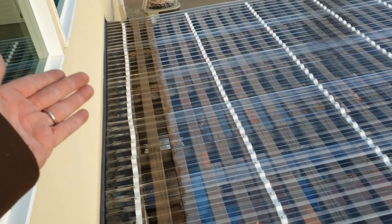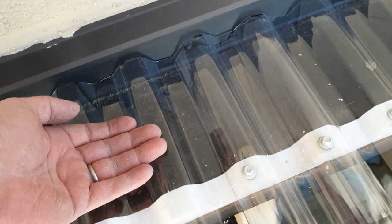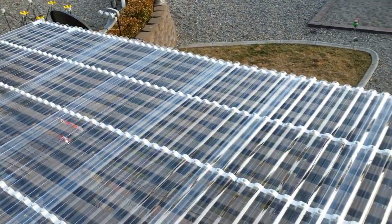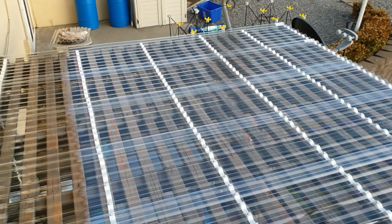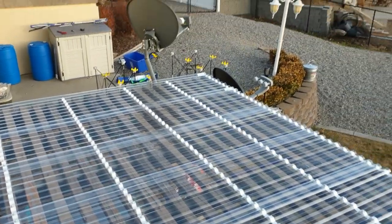Any water that runs straight down this wall could get behind here, so I'm thinking about putting a piece of roof-to-wall edge metal right here to have it come out this way — it'll stop wind-blown rain and water that sheds off the wall. I'll probably do that next. All eight panels are installed. Each one took about an hour and 20 minutes to start, but I picked up speed after that.